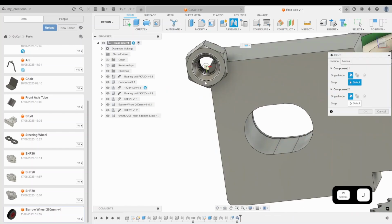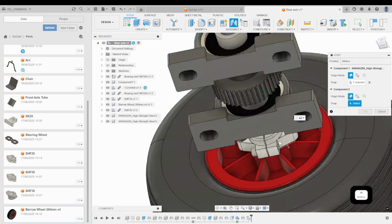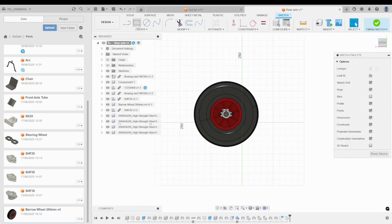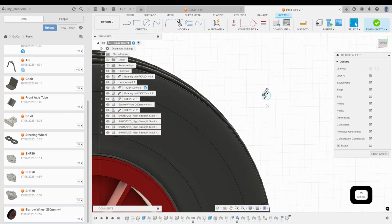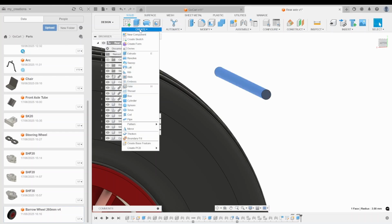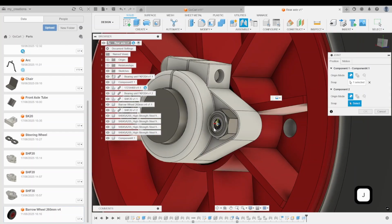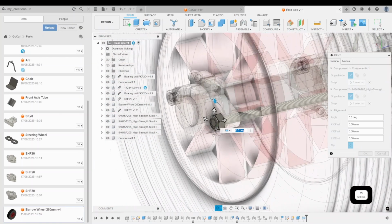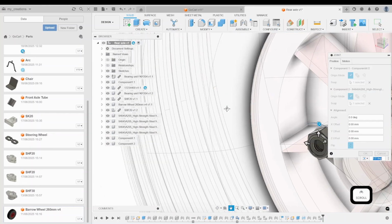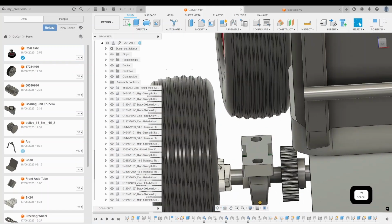For the two drilled holes in the wheel I inserted cut pieces of M6 threaded rod. On the other side I added another SK20 coupling. The threaded rods were secured with lock nuts tightened on both sides. Of course, you could use long M6 bolts, but since I already had threaded rod, I went with that. When the rear axle is finished, we attach it to the baseboard. I used M12 screws, but I will show them in the next video. And with that, the left rear wheel is mounted.